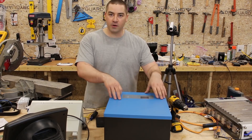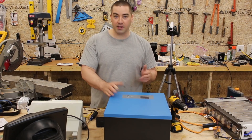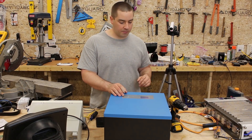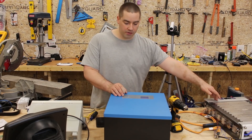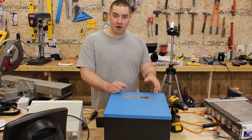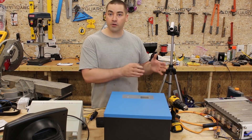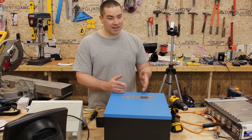The unit does have overload protection — even when I overloaded it with the saw, the unit just shut itself down. The inverter is louder than I was expecting, which is a little disappointing. After shutting off the inverter, it looks like it's still pulling power from the PV panels — a little over 200 watts — floating or trying to charge the battery, just not outputting AC. I haven't checked the generator remote start or the USB output — let me know in the comments if you'd like me to get into all those other features.